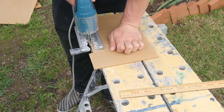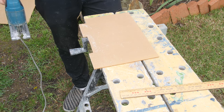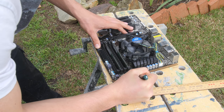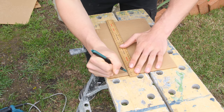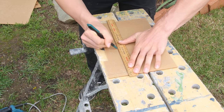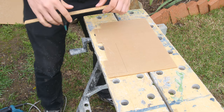Once it is all cut out you want to go ahead and sand it all back to get rid of all the jigsaw blade marks. I sanded back and then gave the acrylic a bit of a wet sand. When you wet sand acrylic you actually see the jigsaw blade marks a lot more when the acrylic is wet, so it's very handy to keep that in mind.